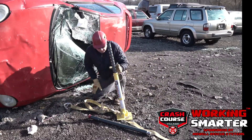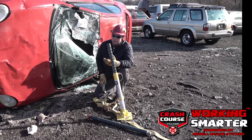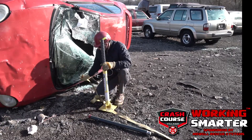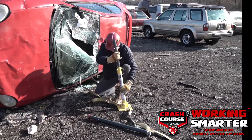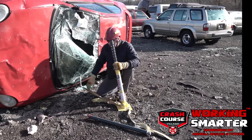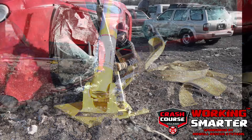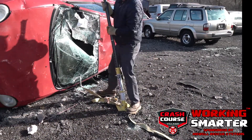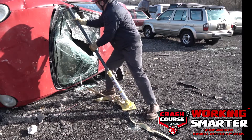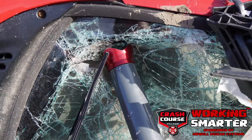Don't care what type of buttress shore you use, there are still some basic fundamentals that are common to most of them — those being the connection points. I want to anchor it down low and keep it in line with that anchor. You want a 45 to 75 degree angle on the tilt and insertion point, and that insertion point needs to be strong enough to handle that weight.